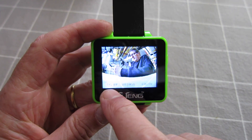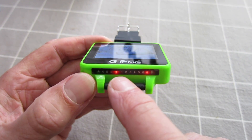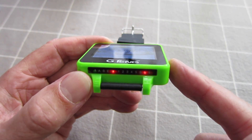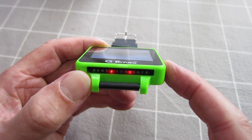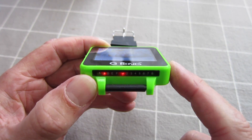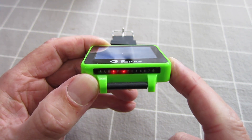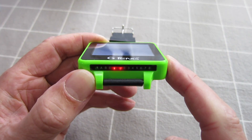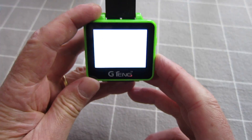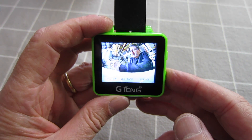Let's just do a bit of close-up. As we can see on the screen, it has all the on-screen stuff that's sent by the camera. We have little indicator lights here — A, B, E, F bands and channels 1 through 8. We push the side button to skip through the 8 channels — see the little light moving there. And we push and hold for a little while, and that skips through the bands: 1, 2, 3. So hold for 3 seconds and you skip through the bands. It's as simple as that. Great little screen.